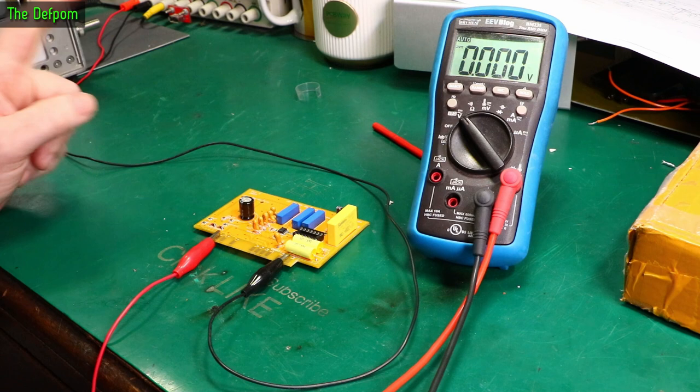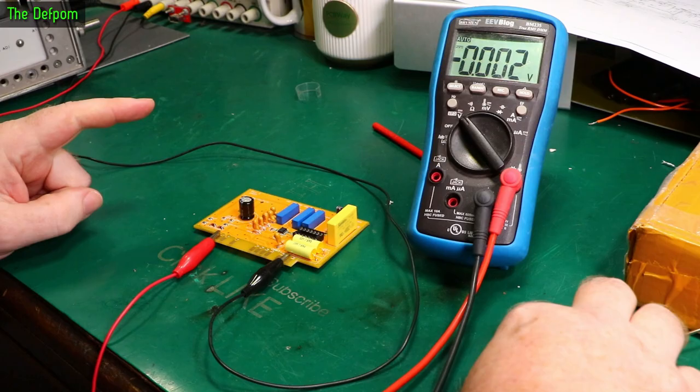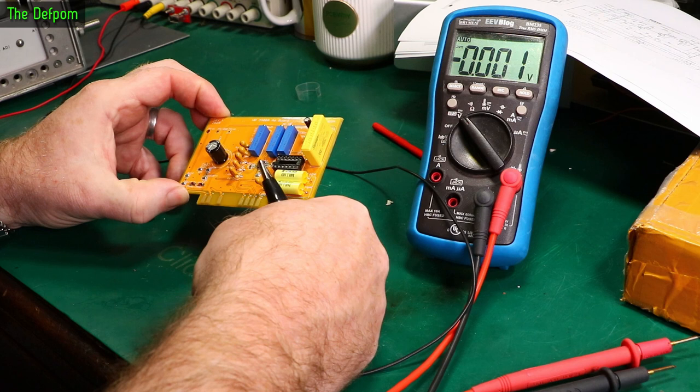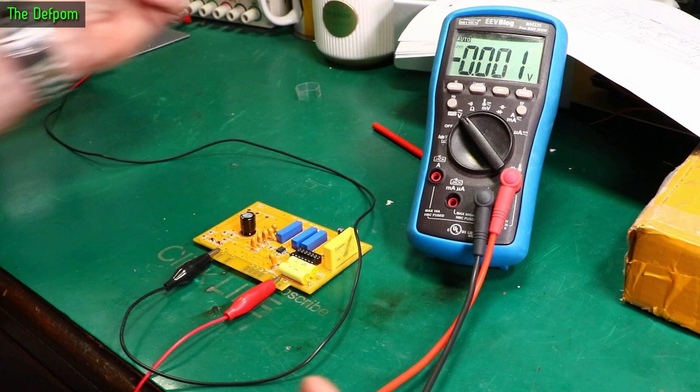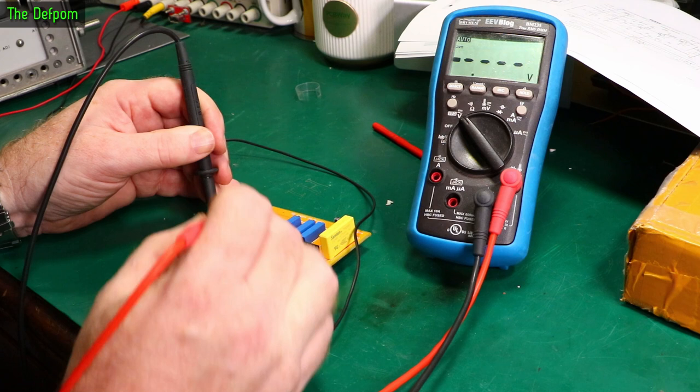I'm going to my power supply and inject 17 volts in, half an amp. I'll do a quick measurement on a couple of things to see if they look okay, and then I'll do a negative 17 volt supply as well. I need to make sure I get these correct — is that negative 17 or plus 17? That is a negative 17 volt supply, so these go the other way around. Good job I thought of that — it could be a disaster. Let's try it; it's drawing 10 milliamps. That's not looking horrendous so far. Let's get a ground point and measure that.